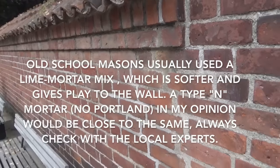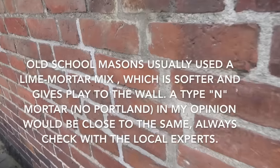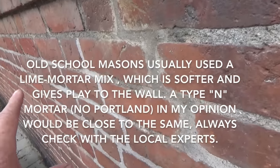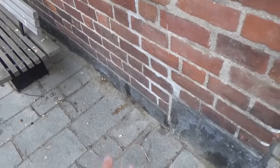Because you've got 150 feet of wall, I don't care what you put in — rebar or what — it's got to crack somewhere. But when you're building a wall like this, old school, you can use a much softer cement that kind of gives, because you already took your problem with the water away from the wall and you've got your water table.